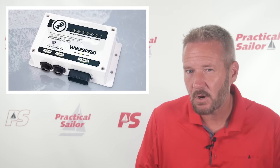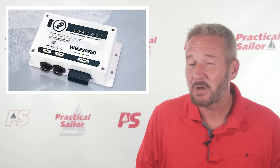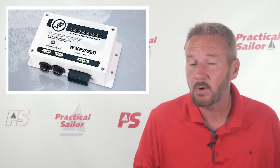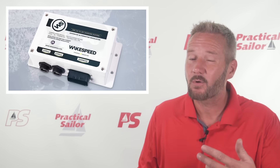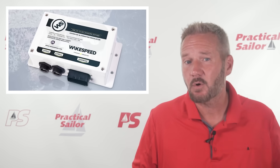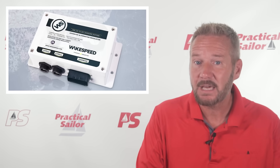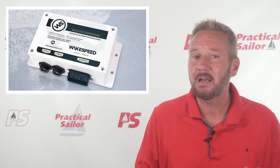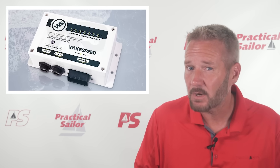It's important to note, though, that there are six or seven highly-used BMS languages. While WakeSpeed will talk to a lot of battery BMSs, it won't work with all of them. The growing assortment of batteries on Amazon — like Lytime, for example — use an in-house design BMS that, while very good at being a BMS for that battery itself, will not talk to outside devices. If you want to use that CAN bus feature on the WakeSpeed, you've got to buy a battery set that WakeSpeed can actually communicate with.